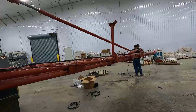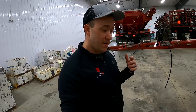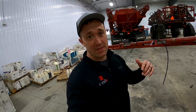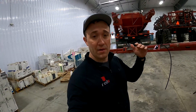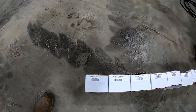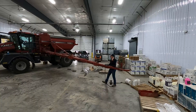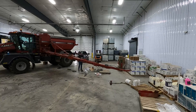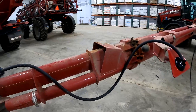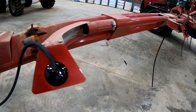All the sensors are on this side of the boom. Got all the hoses on there. Now it is time to start putting on some ECUs. One tip: align all the ECUs in numerical order by their serial number. The reason you do that is so when you open up your iPad, it lists them by serial number from lowest to highest, then inputs them left to right. It saves you a little bit of time on your setup. So we've got 3808, 3836, so on and so forth. The first ECU is on with hose clamps. I'm going to tie up these hoses a little bit better — you really don't have to worry about kinking the hoses if you put a zip tie on them. We'll have to watch where our pinch points are here.